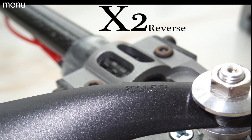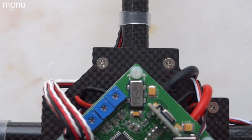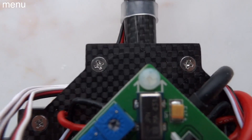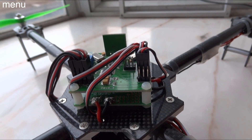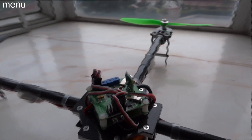Let's get into how to set the board up itself. The next thing is board orientation. You'll notice on the Hobby King board that there are two arrows pointed forward — just make sure that is pointed towards your lead boom. Keep in mind I'm telling you how to set up a stock Hobby King board with the stock firmware in plus configuration. So make sure those arrows are pointed towards your lead boom, your number one boom. I use a green prop up front — people stripe the boom, use lights, whatever you want. Just make sure those arrows are pointed in the proper direction.